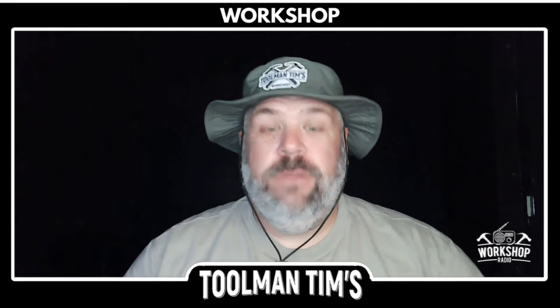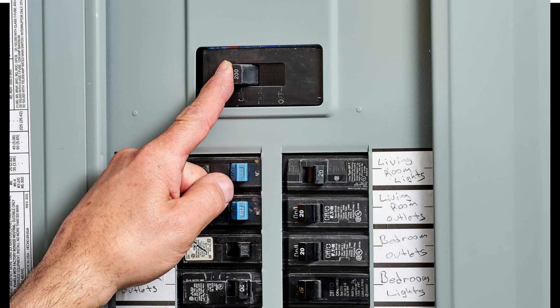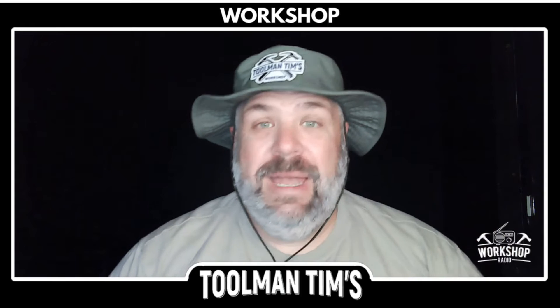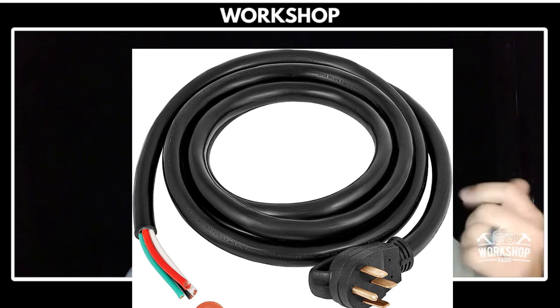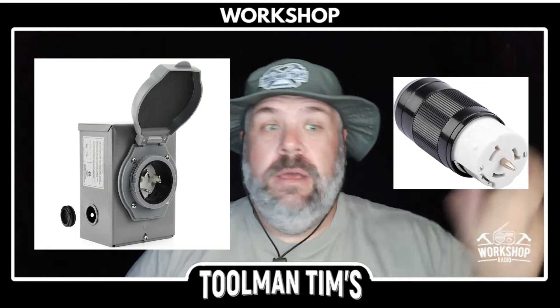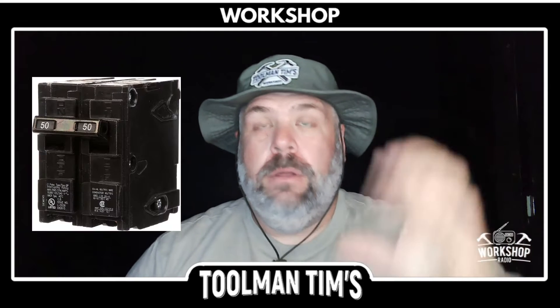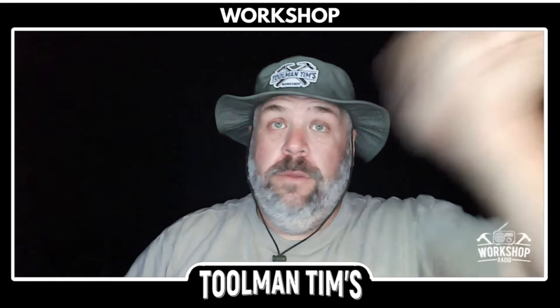Number one, the one thing you have to do before everything else — even though your power is off — you have to flick the main breaker of your panel. If you don't do that, then the power can feed out, get bumped up through transformers, and then give a linesman a really bad day. We need a properly constructed cord of the right gauge to feed from your generator into your outlet or inlet on the outside of your house, to then feed to the proper size breaker on the panel, which will then feed power to your entire panel for your home if the power's out with your main breaker off.